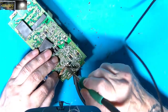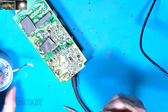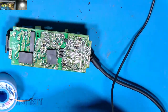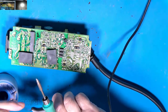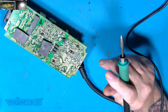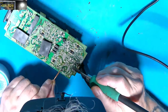If these caps fail — or they start to lose their capacitance — they don't work as they should. Remember what I was saying about the peak value: without these caps, the supply rectified from the transformer comes through a little rectifier to change it to DC — the five volt. Without the caps it ends up at a silly value like about two volts, and of course that's not enough to set up the feedback voltage. It sends out five volt, I think on pin nine, and you need to get three volt back on pin ten before the unit will wake up.